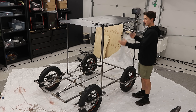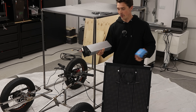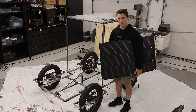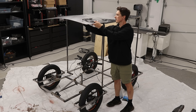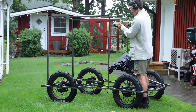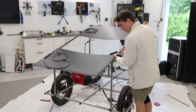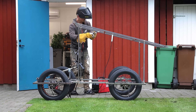Solar panel time. Option A, Option B, Option C — extending the front. In order to charge a 48 volt battery you need a voltage greater than 50 volts coming from the solar panels for the MPPT to even be able to charge it. Because the battery voltage is 48 volts, the solar panels will have to generate preferably higher than 60 volts, and since the output voltage of one solar panel is only 25 volts, we must use all three panels. This got me thinking of the Cybertruck, and I decided to go with an angled roof that perfectly fits the solar panels.